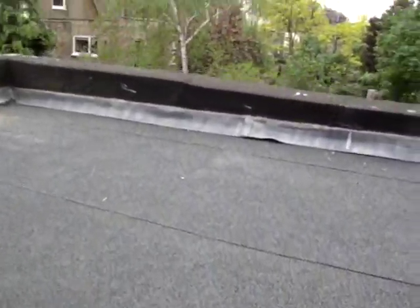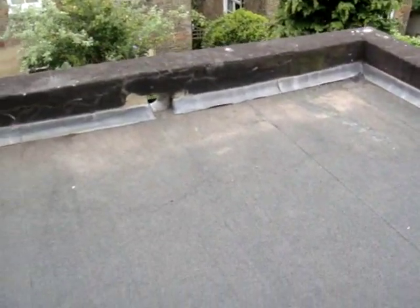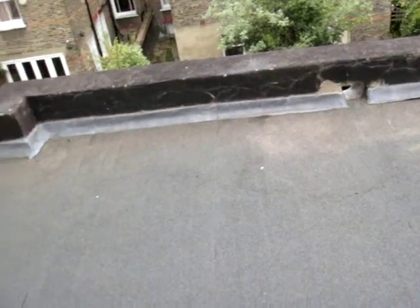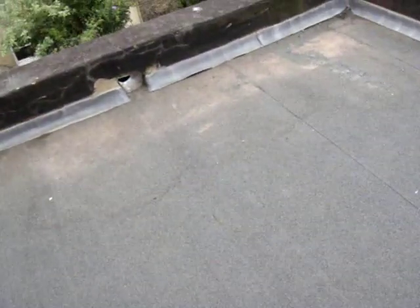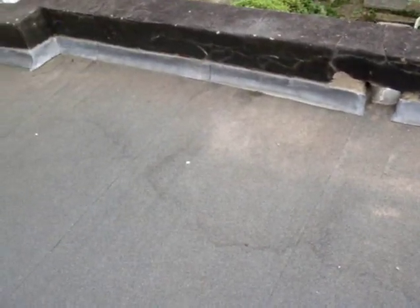If the lady's lucky she's got away with that. One of the reasons why I'm looking at this new roof — and it is a new roof, high tensile felt, really nice felt if it's laid properly — is that if you look at this roof it's pretty new, but what they've actually done is not realise the big problems with it. Although it's probably not leaking from the felt itself, it's leaking from the parapet walls.